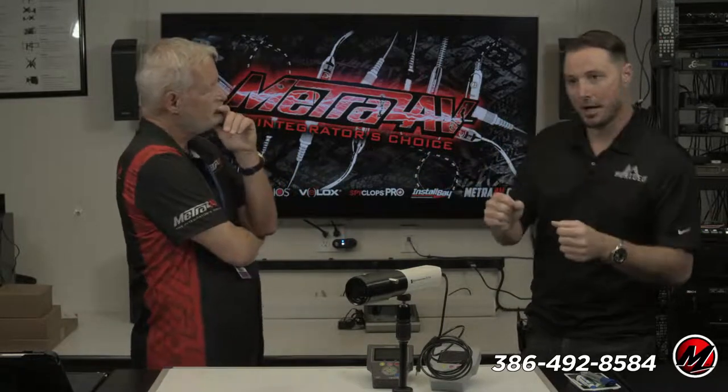So the idea is you calibrate them, and then you have to perceptually match them. So when we're perceptually matching them, we're looking at the reference monitor, and we're going back and forth between the reference monitor and the other TVs. And we're saying, okay, that one still has a little green. Okay, cool. That one still has a little blue. Boom. About an hour later, you've got them all tuned into each other. So after this is all done, we start looking at content, making sure everything's there, shadows, good skin tones, all that fun stuff. And I was flabbergasted at how close that Sony Quantum Dot OLED hybrid matched the 310.